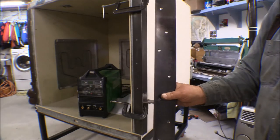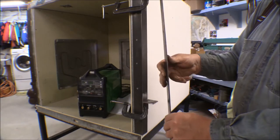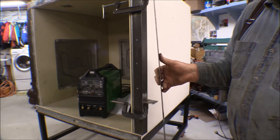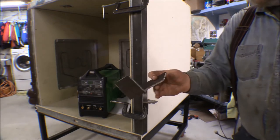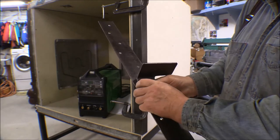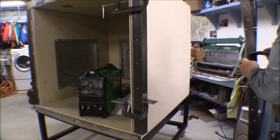I had this piece of 3/32nd inch steel, three inches wide. I went ahead and drilled and countersunk holes in it. I would have liked eighth inch but 3/32nd is what I had, so I'm going to bolt it onto the door frame itself. Then I cut some more of this three inch angle — cut it with a leg on it so that leg can hang over these angles here and we'll make a hinge out of those.